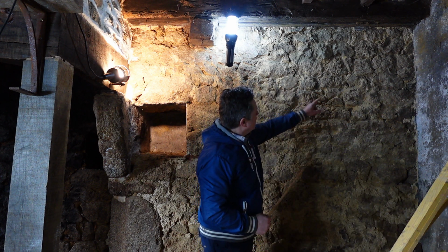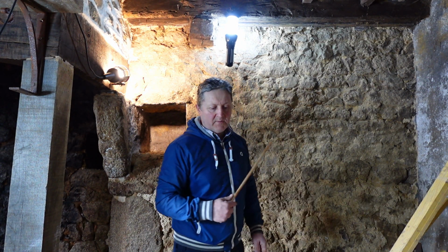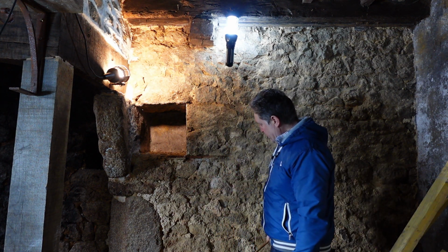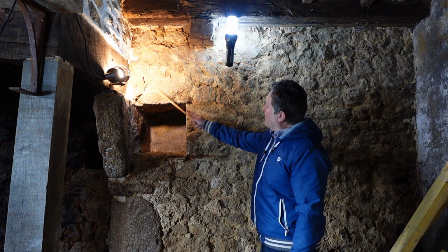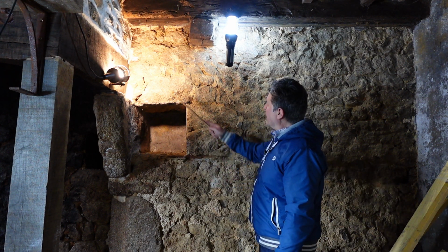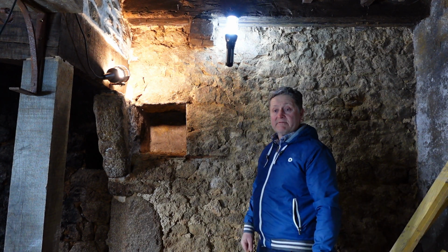Again, it is smaller infill stones. You know, can't point this up, that's why I'm going to render it. I'm going to highlight the big stones, the nicer stones, same as I've done the other side to balance it both up. Get a wire brush around this area, have a clean up and see what's going on, and then yeah, we'll work our way around there and get rendering.